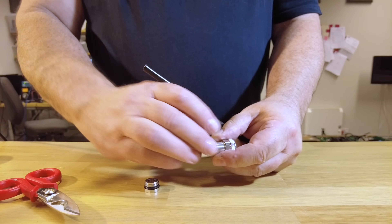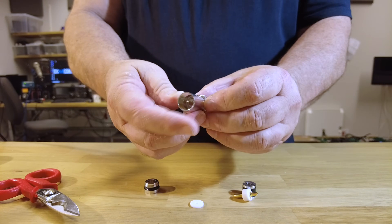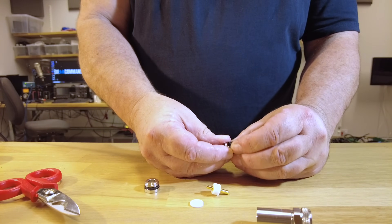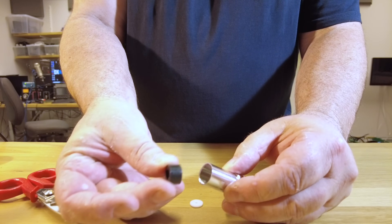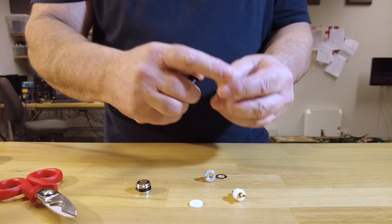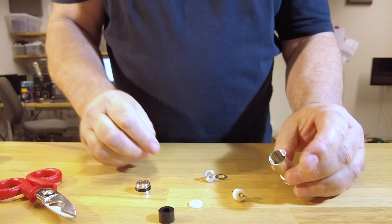Messi and Paoloni - and by the way, SSB Electronics do a similar system - the body of the PL259 comes with a rubber grommet which, once installed, screws down and makes the back of the connector completely waterproof. The threads aren't waterproof; we still have to deal with those and I normally use a bit of Vaseline there.